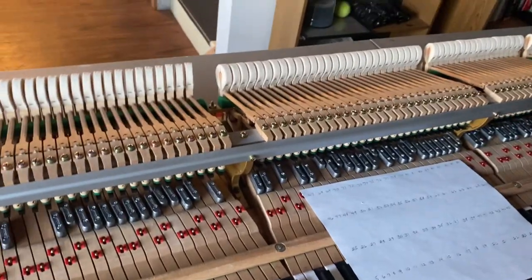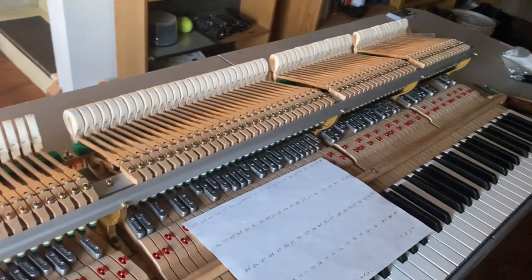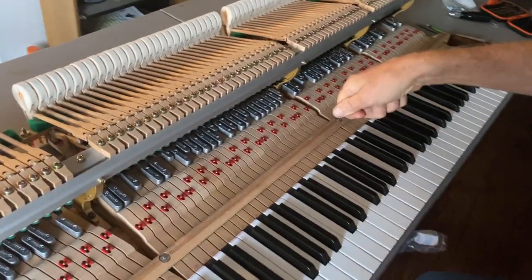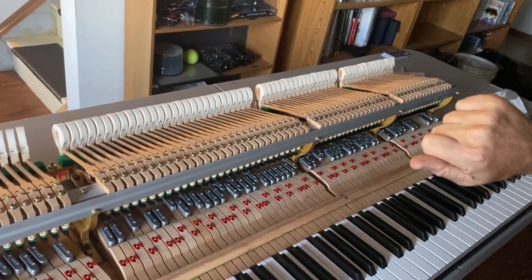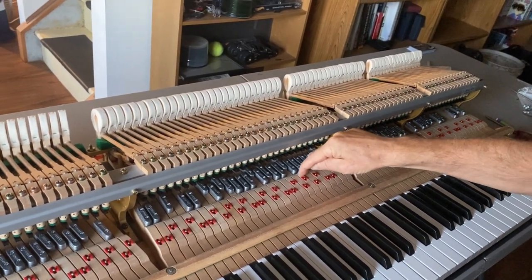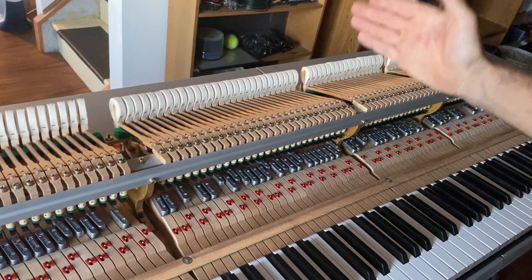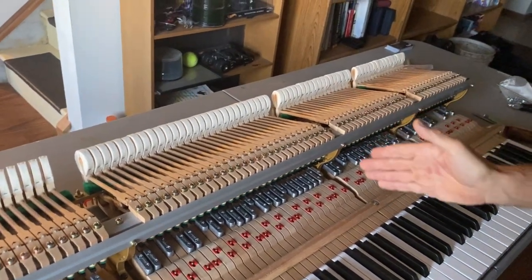Then I didn't use, a lot of times you say, oh, let's just use a drill. And we go boom, boom, boom, and zip the screw in. To save time, but bad idea, right? Well, in this context, it is kind of a bad idea. Just use the ratchet screwdriver to screw in each one of those, because then I could feel when it bottoms out and there's less danger of damaging either the threads going into the wood. Because this is of hardwoods, the wood that's used here is toward the softer end. And also there could be a danger, because it is a hardwood, of cracking the wood. We don't want to create cracks and we're causing greater wear to the keys. That's why we drilled first.